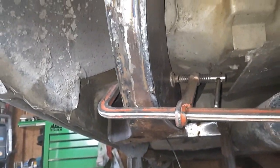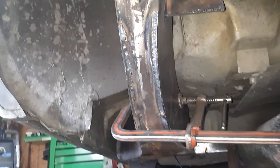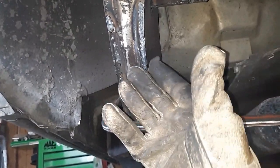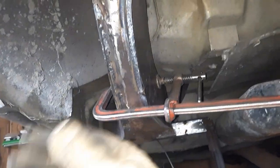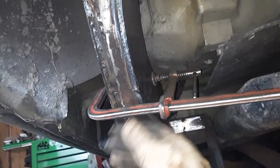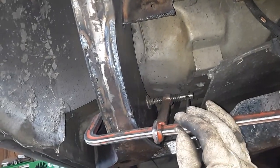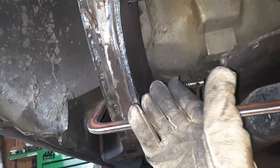Back in the day, on I Lay It Low, I don't know how many of you guys watched that, but everybody would talk about using a hammer, using heat to bend metal. Well, when you weld it, it heats up. When you cut it, it heats up. Yeah, you don't want to go where it's glowing red where you can just move it by blowing on it. Yeah, that does make it weaker. But you're going to be welding on it. It's warm. Use that to your advantage.